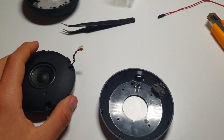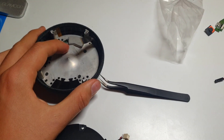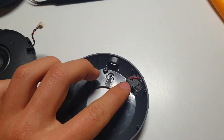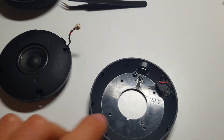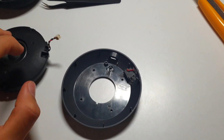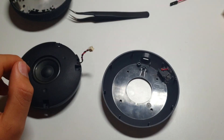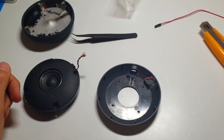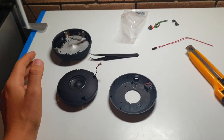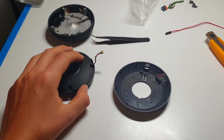So here is where the signal comes from the top of the Google Home Mini. We need to make a line from here to the aux port, and then from the aux port to the speaker. The line from the aux port to the speaker will be engaged when there's nothing plugged into the aux port. In the description below I have a wiring diagram, and I think that's very useful — it's basically all you need. I'll be back in a second to show you what that looks like.